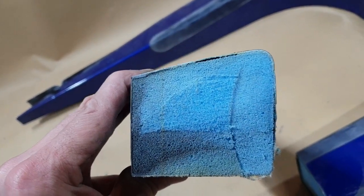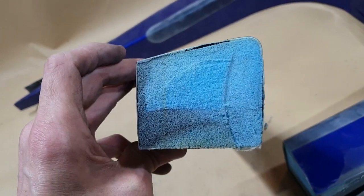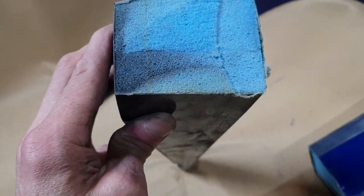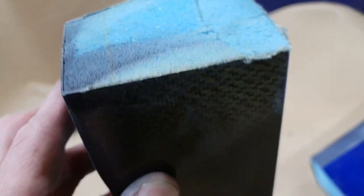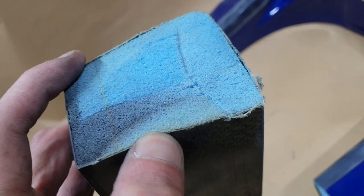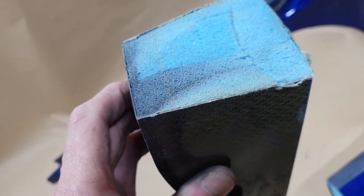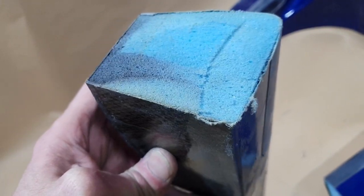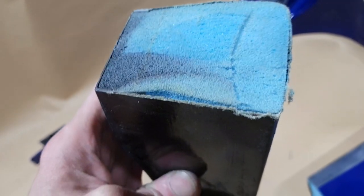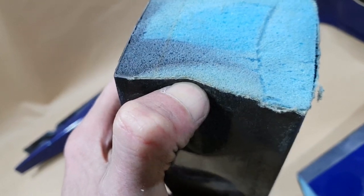So going back to what the thin layer of carbon fiber was made from that can collapse, I'm going to go back on what I originally said, that it was an epoxy that was flexible. It's actually not. It's a carbon fiber Kevlar weave. Now hopefully you can see the Kevlar there. You can see the yellow and the way it's frayed. So that's why it's so flexible. The Kevlar, as you know, is used in bulletproof vests, timing belts, all sorts of belts like that, clothing and various things. So it's not as brittle as carbon fiber. And this weave here is mainly Kevlar.